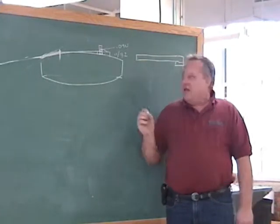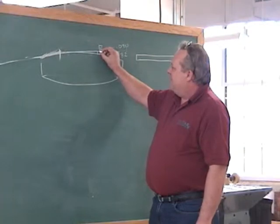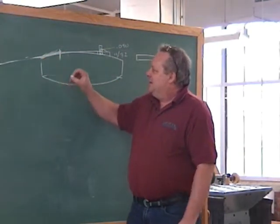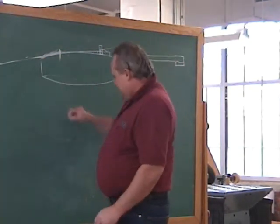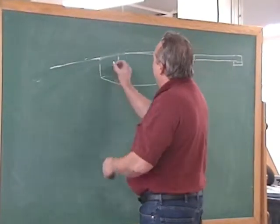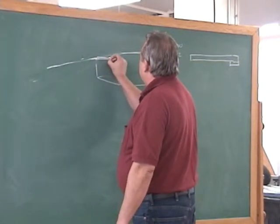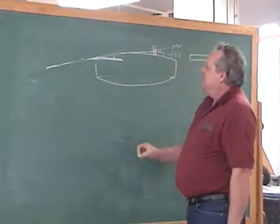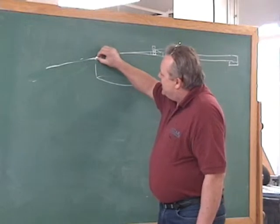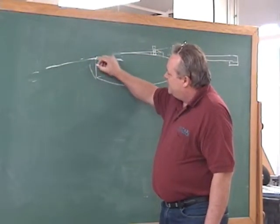Every time. If I'm resetting a neck on a Martin, that's what I do. Set this to 90 thousandths. It's inevitably going to end up with some fall here because the body geometry isn't right. The body geometry is flat. So now my tongue looks like this. I'm exaggerating. But from here to here is what you're changing, this angle, where you remove it from the heel.